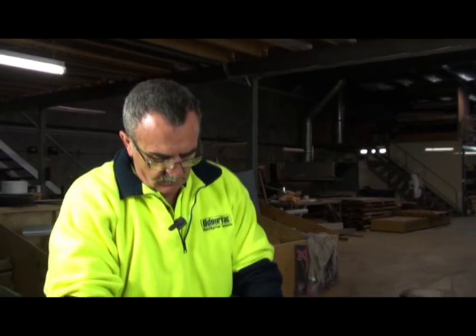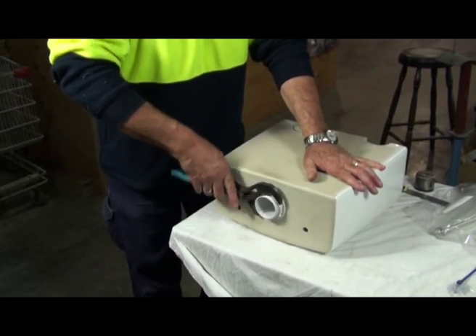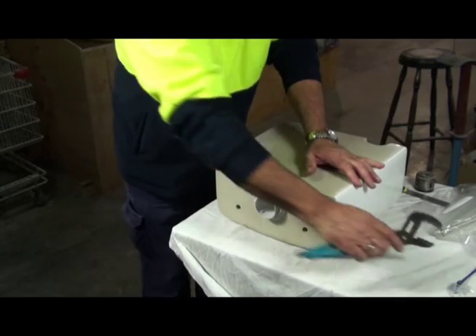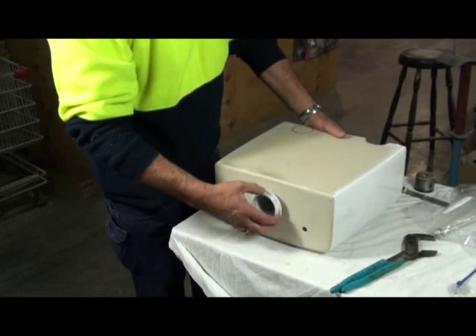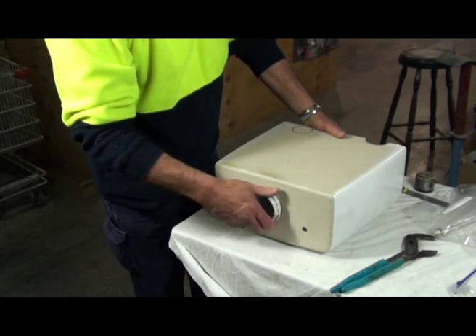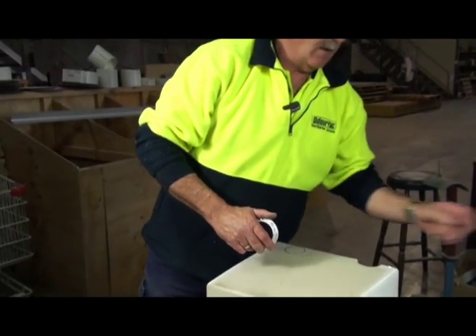Before drilling the hole, we need to take out all the flushing system inside the cistern. To do that, just use a pair of multi-grips and release the big nut on the bottom of the system — just a couple of turns. It's not too hard. It's only plastic, you don't have to force it. Just spin it off and take it out. That's for two reasons: one, you don't want to go too far through with your drilling and cause damage; also, it's easier to clean out all those little chips once you've drilled it.